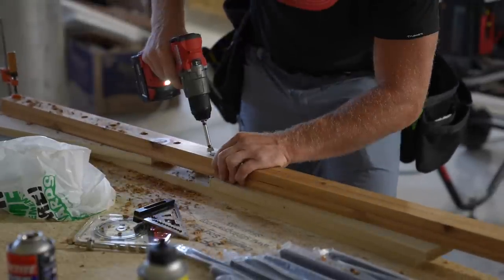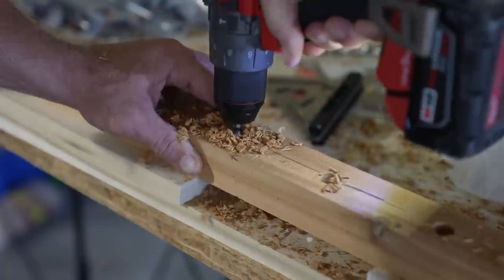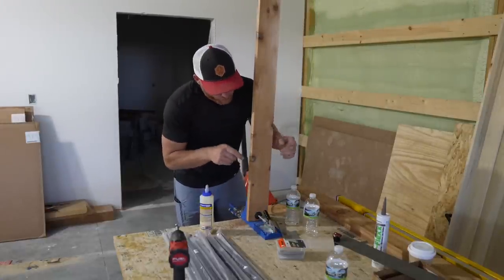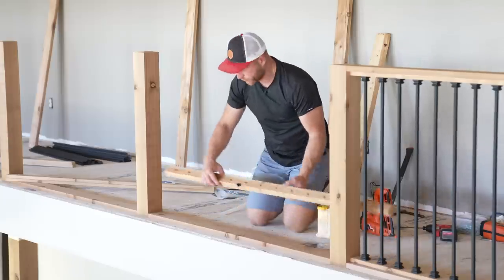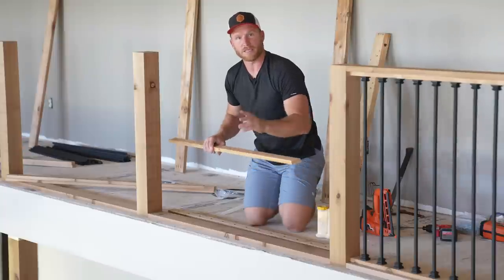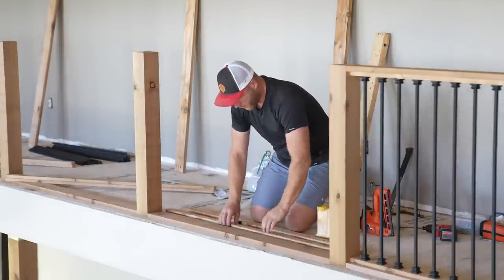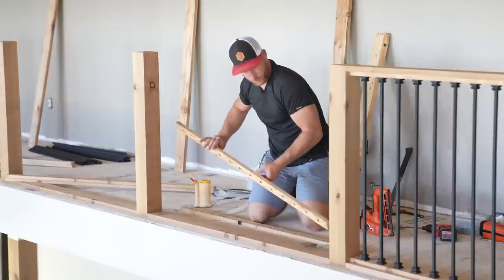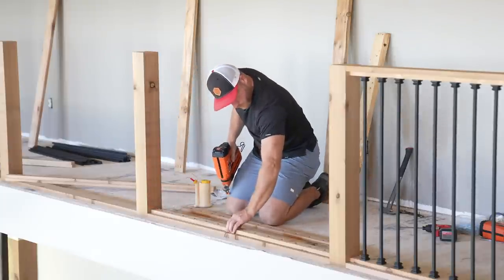This is one of those times I wish I had a portable drill press. These are the top pieces and since we can, we're going to go ahead and use the pocket hole screw jig — nice way to fasten this without being seen. I've got the holes drilled in my tops and bottoms, labeled and marked with an arrow so all pieces face to the east, just for consistency. Now I'm going to put some glue on the bottom of this and then we're going to nail this down.